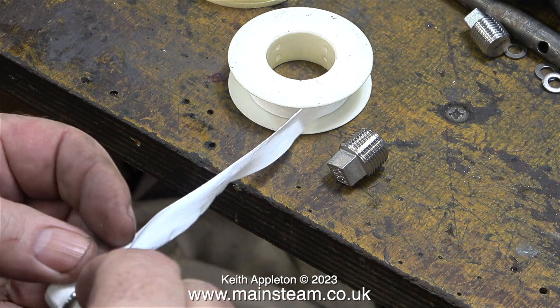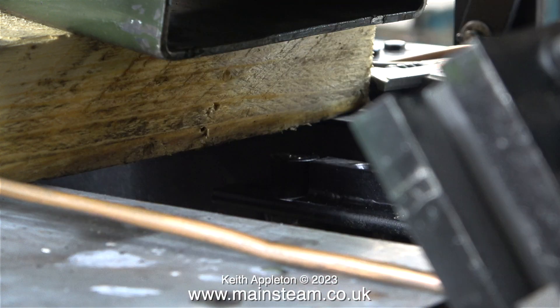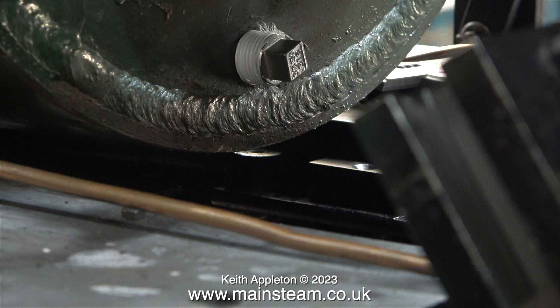This is something I don't do very often — I'm winding PTFE tape around a blanking plug. Why PTFE tape and not Loctite 542? Mainly because it seems to be the convention on plugs of this type. If you re-watch the last clip you'll see that I'm winding the tape onto the part from underneath at the back — this means as I tighten the blanking plug into the hole, it's going to tighten the PTFE tape rather than try to wind it off in the opposite direction. I use the same principle when fitting graphite yarn into stuffing glands that use a threaded gland cover — that way, as you tighten the gland nut, it doesn't unravel the yarn. Now it's time to use my late father's crowbar to lift the back of the boiler and sit it on a stout piece of wood, to allow access to the 3/8 BSP plug in the front of the firebox.